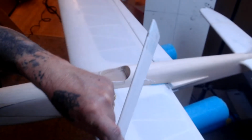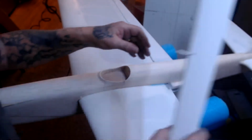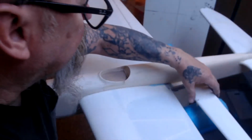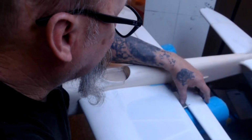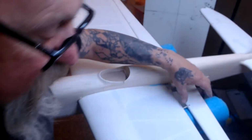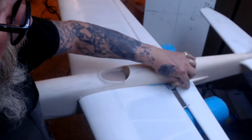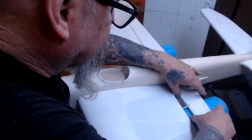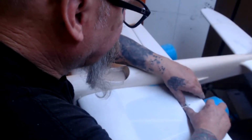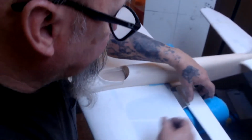It's the right dimension here, and then it goes down, and well, would somebody notice that? Man, maybe. I notice it. Would Jim Lynch notice it? You bet. Say, what are you gonna do about that? Well, we can't have that, so I got to change it. So I'll just cut a notch out of that flap, like a trim tab in there. Glue in a piece of 3/8, sand it to the correct shape, and refinish that little spot. Not a big deal. It's only wood.